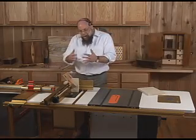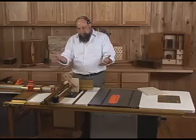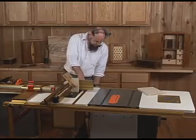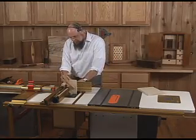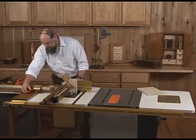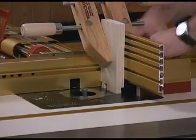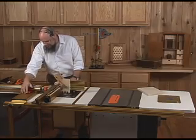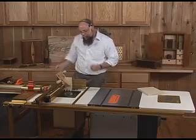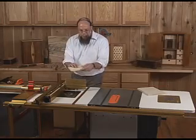The information on the template is really simple. If it takes two boards to make a corner, the template will have two sets of lines, and the lines are just labeled so you can tell them apart. We're going to stop at the blue lines labeled A, right through the hairline cursor, in order to cut these tails. First step, just take a nice light pass to break into the board, go to the first line labeled A on the template, and every time we cross a line labeled A, we'll just take another pass. You can see that it's not necessary to spend a lot of time looking through the cursor, tapping the fence back and forth before you lock it down — you're just getting close. When you lock the positioner, it sets that final fence position for you. When you run out of lines, the tailboards are done.